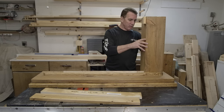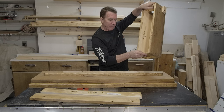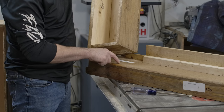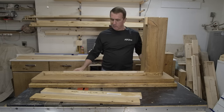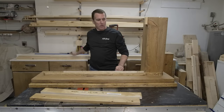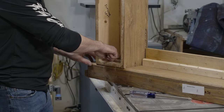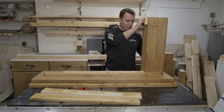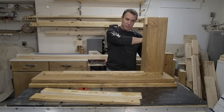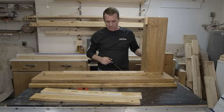Now I'm going to set it right on there. I put some lines on the back of here that are going to line up with the base plate, so you can put it right on and see where it settles. Then I have these bolts that are going to go right through here and screw into some recessed nuts that I have put into the base. We're going to tighten this down with a Phillips screwdriver — that's the only tool that you need. Tighten that down and it's nice and firm.